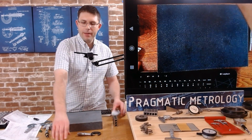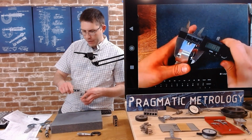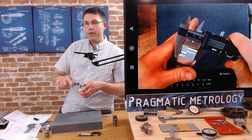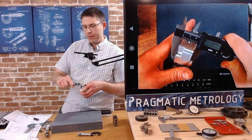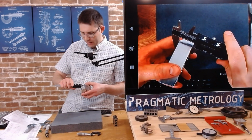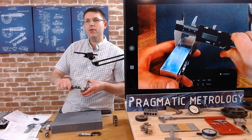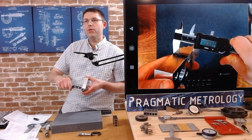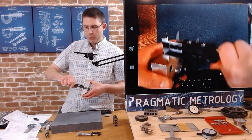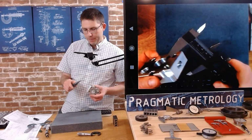So let's verify that with our caliper. We've done this before. My thicker side was over here, right? It's showing me about above an inch or right at an inch, a little pressure. And then I did my second measurement over here on this side. And you can see once I get everything registered, it's a little bit lower. So this can be a great tool to double check your work. This is a little bit easier to check because I can grab so much more area with a caliper than I can with the micrometer.